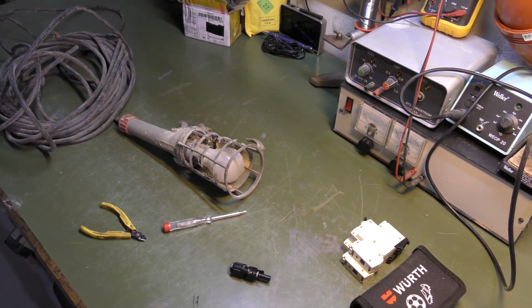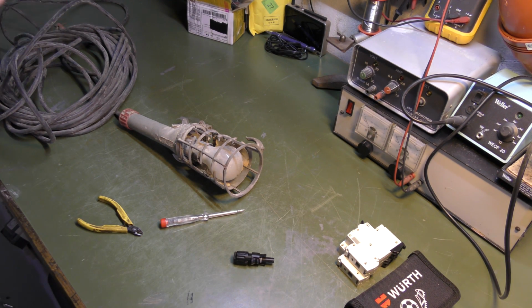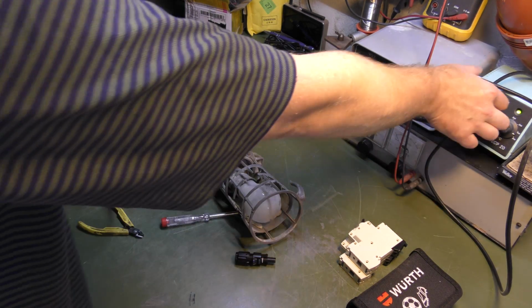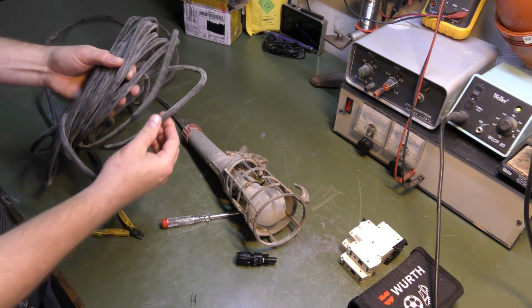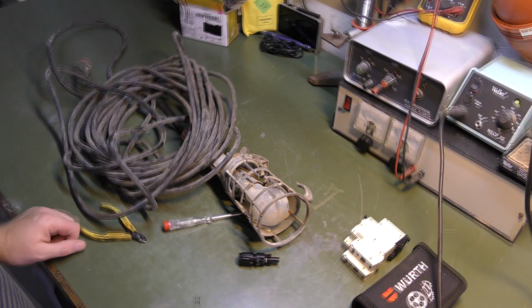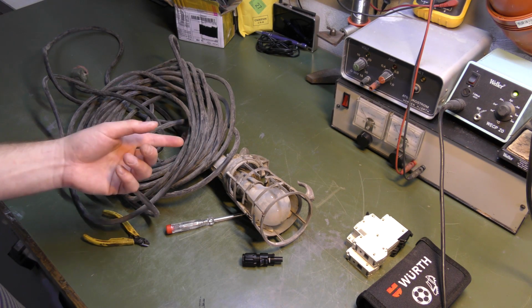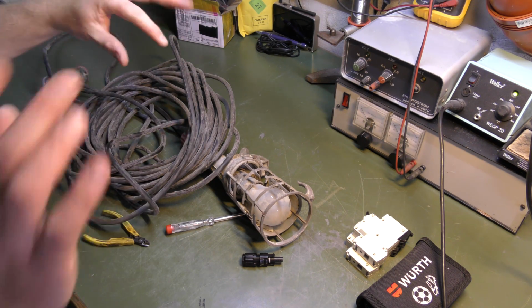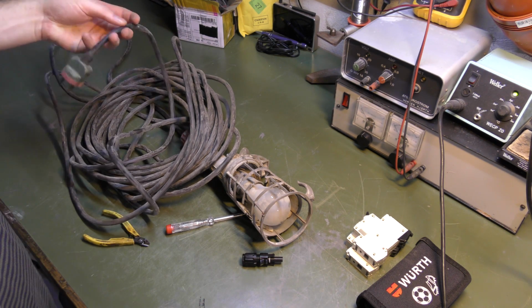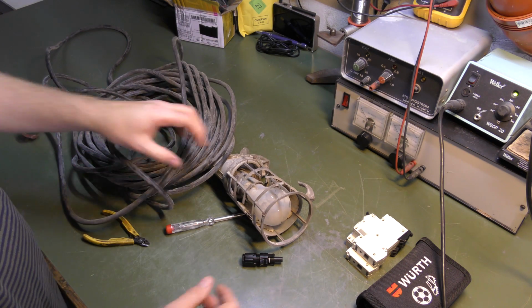Okay, to put up the next string of solar panels, I need to make a cable for the minus side. That's a long cable, and I forgot to buy some solar cable, so I'm gonna cheap out again and use some regular appliance cable. This lamp will trip the earth fault device, the HFI relay. So this is just junk, and I'm just gonna steal a piece of this probably okay cable.